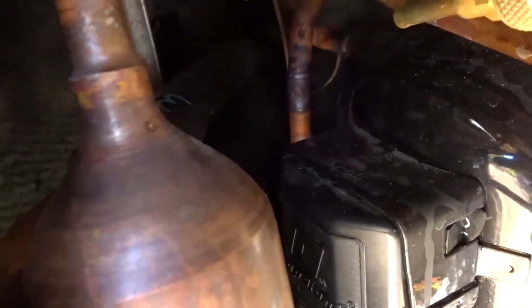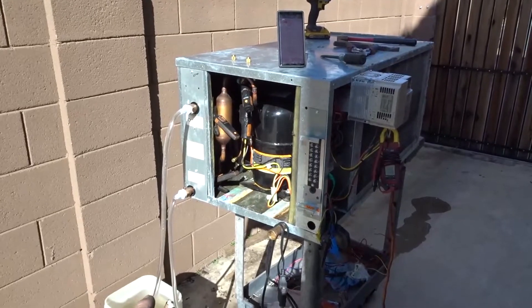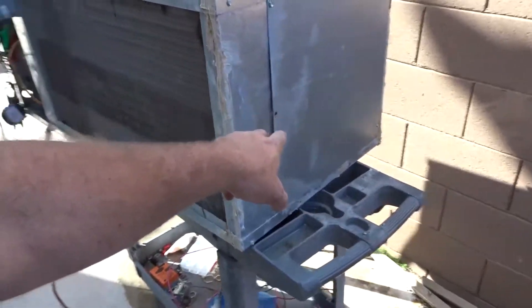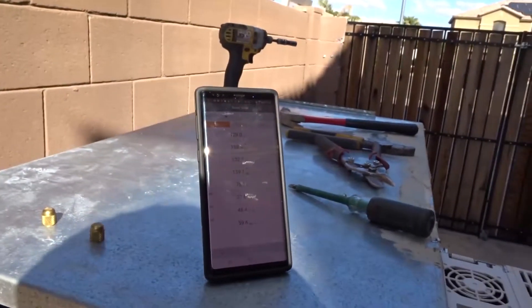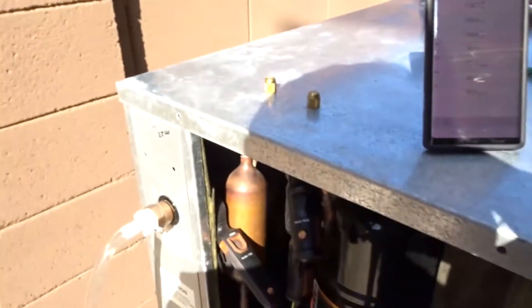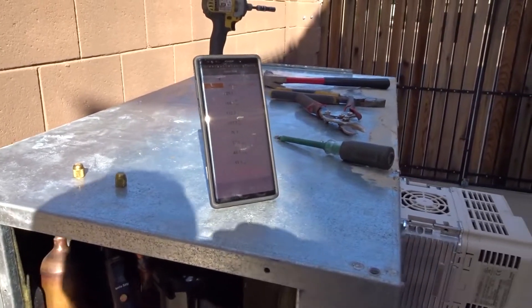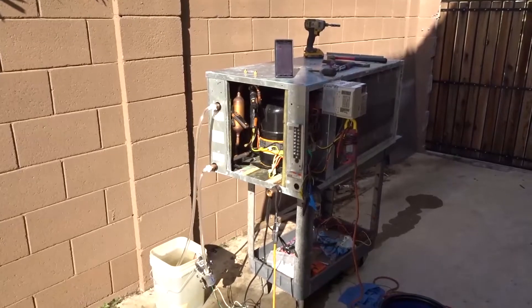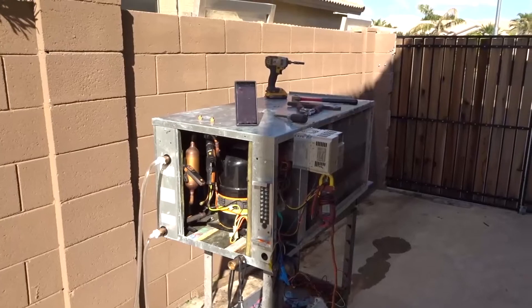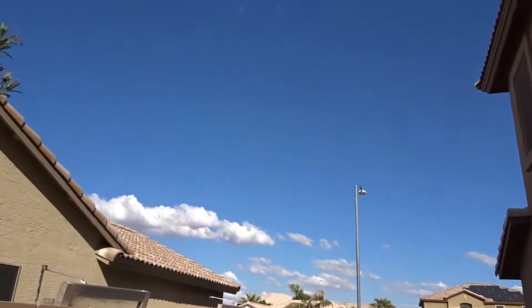Just to recap: I took the three-ton 460-volt compressor out and put in a 230-volt two-ton compressor — still three-phase. Took out the 460-volt blower and put in a 230-volt blower from the Trane unit, so it has the bigger wheel on it but I have it on low speed. The return water got up to about 130 when I stopped, so it heated the water to what I wanted, but the head pressure hit 400 to do it. More gallons per minute is my next goal. At least I pulled off a little operational check and set this thing up within about 20 minutes — not bad.